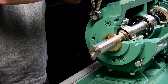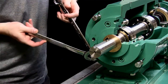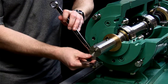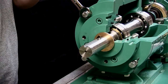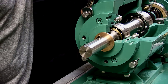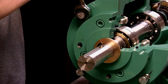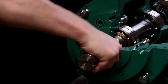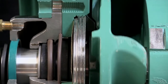Loosen each of the four clamp bolts on the bearing housing cap about one half turn. Be careful to prevent the adjustment sleeves from turning with the clamp bolts. This operation is usually performed with two wrenches — one on the adjuster and one on the clamp bolt. Move the impeller closer to the upper cutter by rotating each of the adjustment sleeves one flat clockwise and then tightening the clamp bolts onto the adjustment sleeves. It is important to turn each adjustment sleeve exactly the same amount to keep everything parallel. Turn the motor coupling by hand to check for interference between the impeller and the upper cutter. Repeat this step until you feel interference.